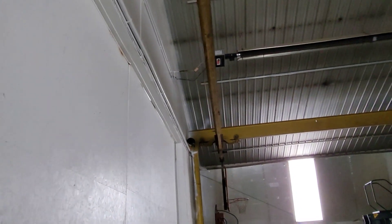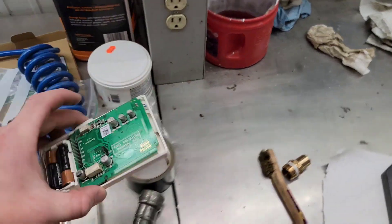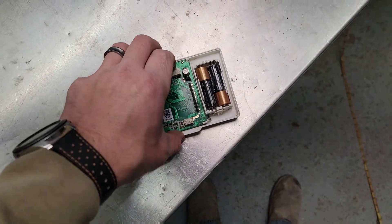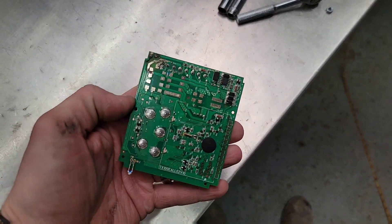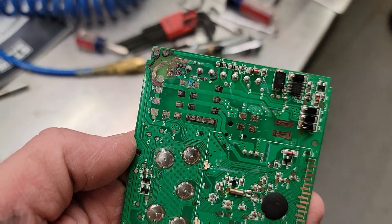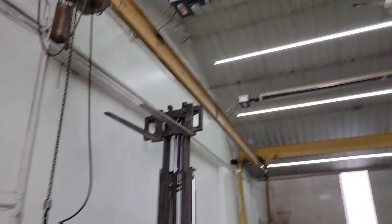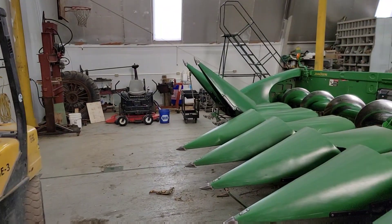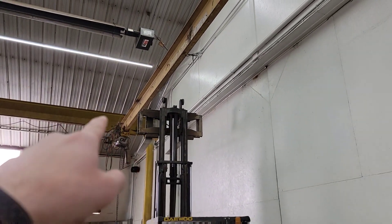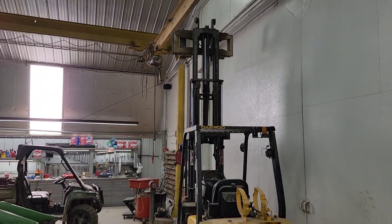By the time you guys are watching this, I've already decided whether I'm going to do that or not. We had a thermostat die on us — we tried replacing the batteries, that didn't work. There was some corrosion on stuff, we tried cleaning it up but that didn't help either. I ended up taking the board out and tried cleaning it — it didn't work. There was a bunch of corrosion all up in here on these tabs; one of the batteries was leaking. So for some reason when we installed these two heaters we put two thermostats in, one on each side. I'm thinking I can just take the wires off of this thermostat and tie them into the one for the other heater, run them in parallel, and it'll control both heaters rather than having them on their own thermostats.